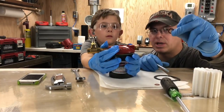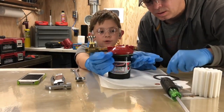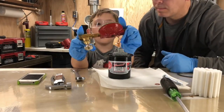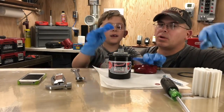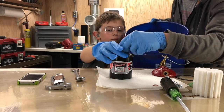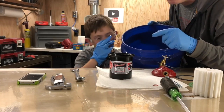It's very important that you change this fiber gasket every time you change a fuel filter. Be careful, because when you lift this up it's going to be filled with fuel — not gas, fuel oil. You don't ever put gasoline in your furnace. Pull it out of here — you're going to want to have a bucket close by and throw it into the bucket. That way you don't make a mess, otherwise it's going to drip all over the place.